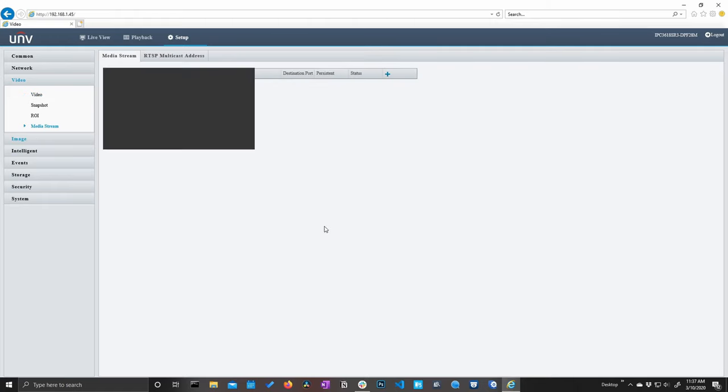Back here at the NVR, it looks like we are going to have to adjust the sensitivity just a bit — it counted two exits instead of one and then one entry. What I'm assuming happened is my shadow crossed that line and it thought there were two of us. What I can do is bring down the sensitivity a bit to maybe 40 or 35. Another thing I could do is enable this shoulder demarcation and see how that works.